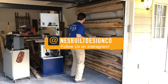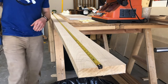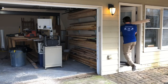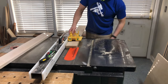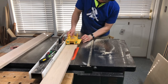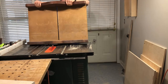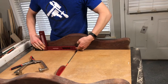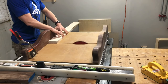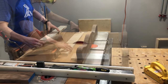To kick this project off, I went into the garage and grabbed some five-quarter maple that I've had acclimating for a little while. I broke it down so I could take it into the shop a little easier. Once I got into the shop, I ripped it down to a four-inch width so the three grooves would be nice and evenly spaced across the board. After cutting it to width, next up was cutting it to size. I set up my crosscut sled and cut it to one foot — plenty long enough for any chopstick, and one foot just sounded like a good number.